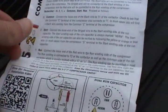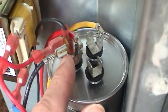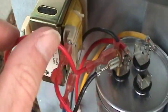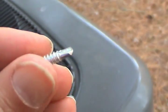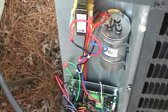The kit comes with complete instructions on how to wire everything up — everything you need to know. I've got some extra adapters so I can multiply the number of terminals available on the capacitor, since I seem to be running out mainly because of this auxiliary transformer setup. Let me go ahead and drill a pilot hole here, then we'll get the thing mounted. It comes with a nylon strap that you can screw in and a couple of self-tapping sheet metal screws. Let me get it mounted mechanically and then hook it up electrically.